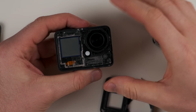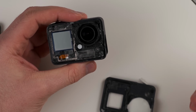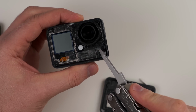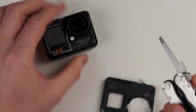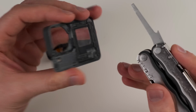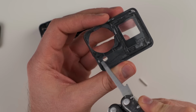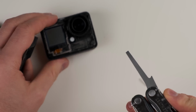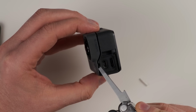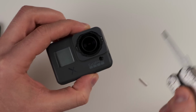Now we can take a good look at this wind microphone, and this is actually much different than the stereo microphones. It has a much thicker and wider diaphragm. It's meant to work in higher pressures. Now it's connected to the outside world through this channel here that you can see engraved on the inside chassis and on the back of the front cover. Now I drilled this hole in here trying to experiment with different microphone configurations. I would highly advise against ever doing this to your GoPro. It didn't work the way I thought it would.